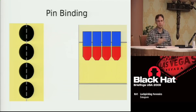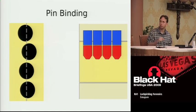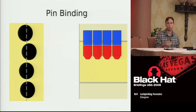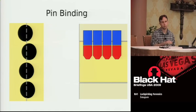So when we say we want to pick a lock, traditional lock picking exploits problems in manufacturing tolerances with locks. So you might think when we turn that inner piece, the plug, that we're hitting against all these pin pairs at once, and in the animation you can see them jiggle. But what really happens is that either the pin chambers are slightly misaligned like in the photo, or the pins are slightly sized differently, or they're oval. Various defects allow one of those pin stacks before another to be sheared between the plug and the cylinder when it's slightly rotated.